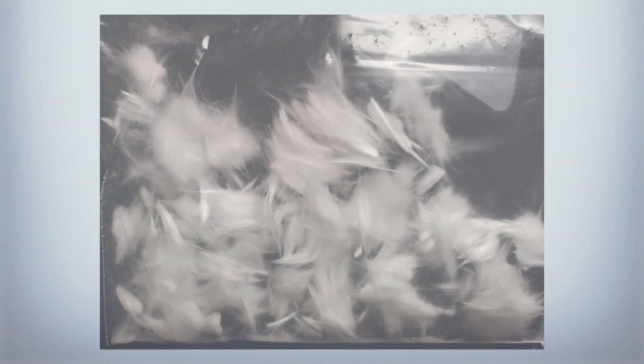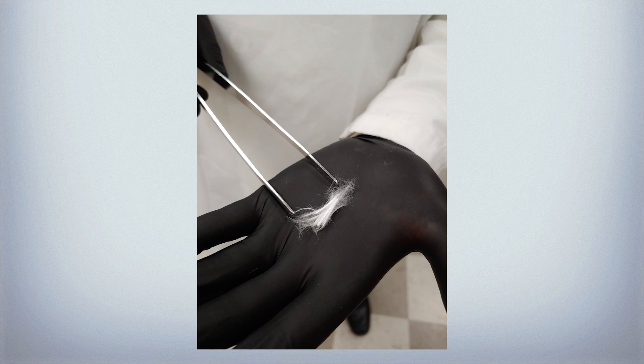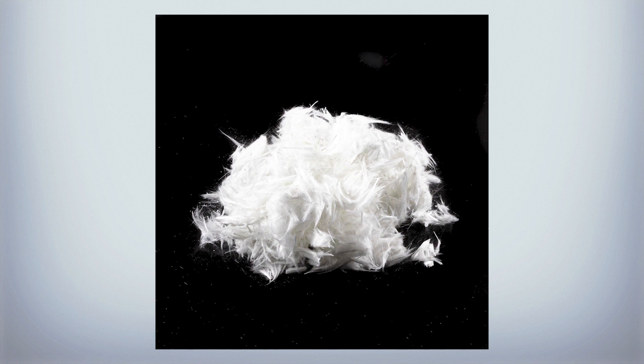Ryan explains how it works in more detail. Some of the petrochemicals that come off are cycled back into the process to maintain the temperature, so the recycling process itself becomes self-sustaining. The energy obtained from the polymer components provides the energy needed to recycle. As it comes out the back end of the setup, we have our ultra-clean surfaced, relatively mechanically intact glass fiber.